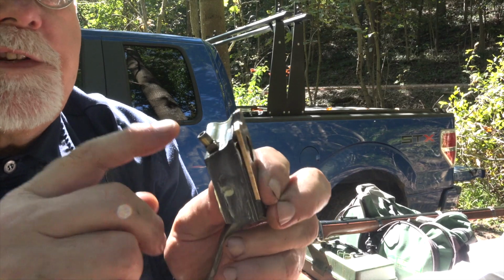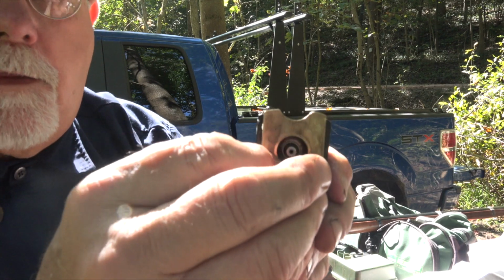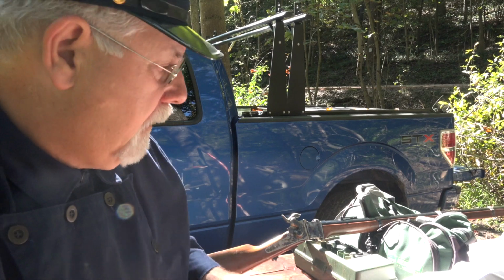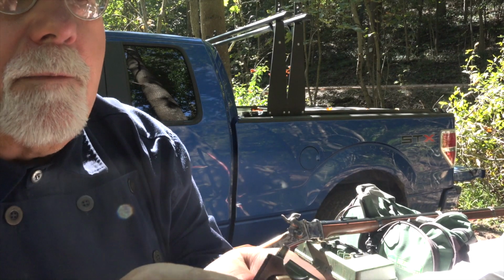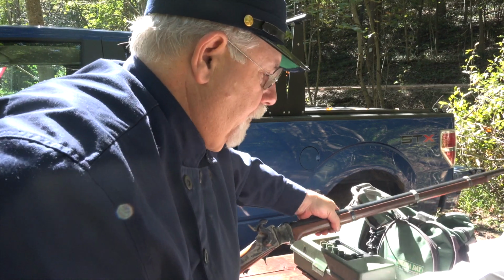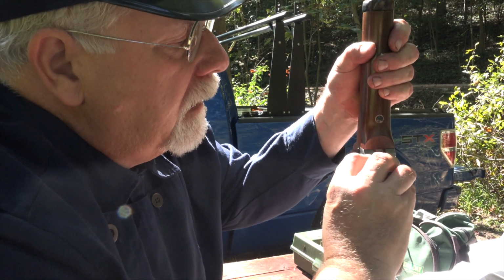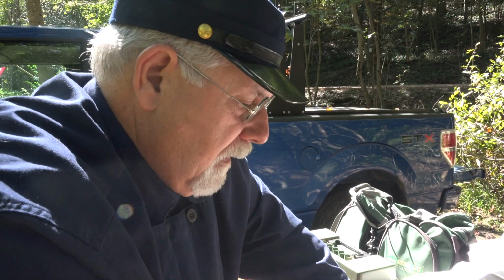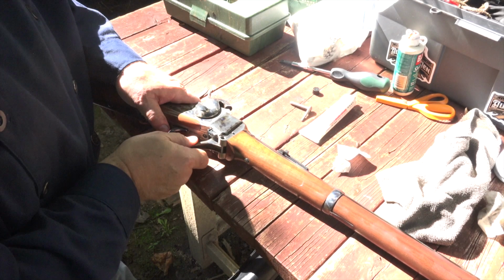Okay, so I've lubed up the sides of the breech block with white lithium grease. Right, I'm putting the plate back in, bearing up against the O-ring. Now, I'm going to reinsert the breech block. Right. Now I just have to get that pin lined up and put that in. Okay, I'm going to get the pinhole lined up.